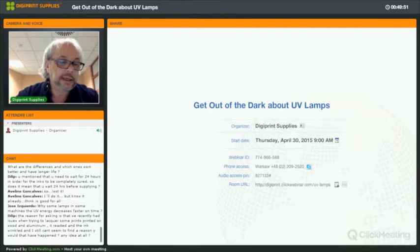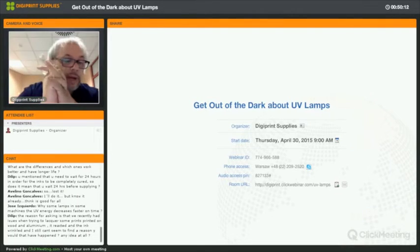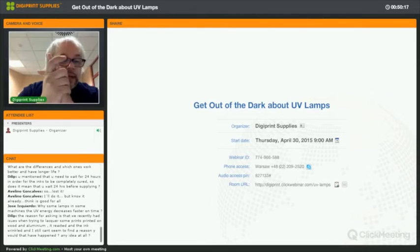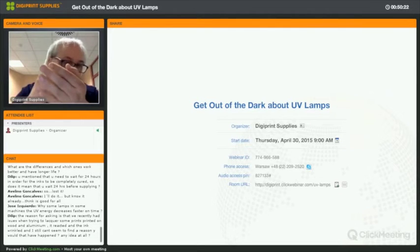So you printed on, what did you print on? Wood and aluminium, okay. And then you had a reaction between the lacquer you put on there and the ink. The ink started to wrinkle. Well, first of all, I think that you described the problem or the reason why it happened is that the lacquer reacted with the ink. The question is, before you lacquered them, did you have good adhesion of the ink? Were you able to scratch it off very easily?